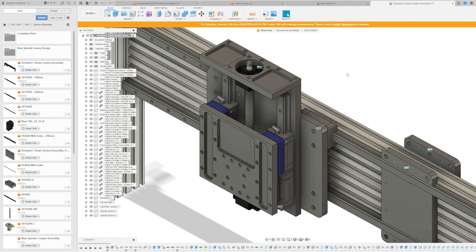I also liked adding a little weight relief — you have these pockets that are cut out. A little bit of weight relief never hurt; it allows you to accelerate just that much quicker. As an engineer you're always thinking about bragging rights and how quickly you can move things. It also just looks really good when you have pocketed aluminum like this — it looks purpose-built and like a lot of care was given to the design. Let's get into the video and see how this design hits the metal.